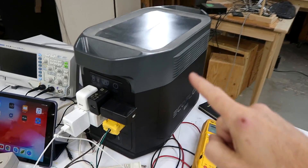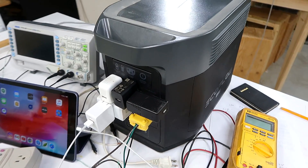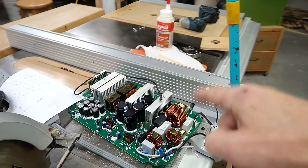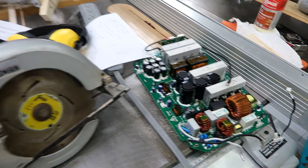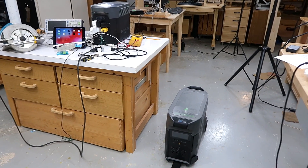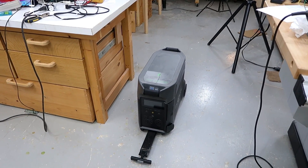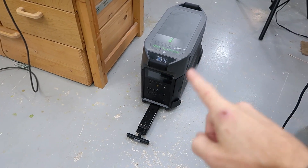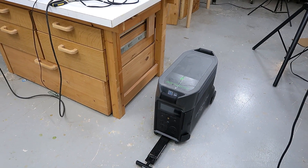I won't test it with this power metering gadget because it uses a power supply design very similar to what's in the kilowatt — so just like the kilowatt, this one might get damaged from those oscillations. But even though the EcoFlow is quite good at not blowing up from overcurrent, I did blow the inverter on it by accidentally connecting neutral to ground, which is why I have this spare inverter board that's busted. Another YouTuber had also mentioned that he'd blown the inverter on one of these Delta Pros, also by connecting neutral to ground. The EcoFlow is pretty good about not blowing itself up unless you connect neutral to ground, so don't do that.